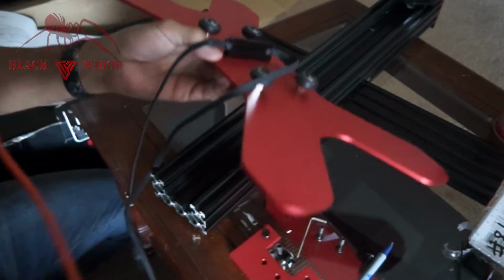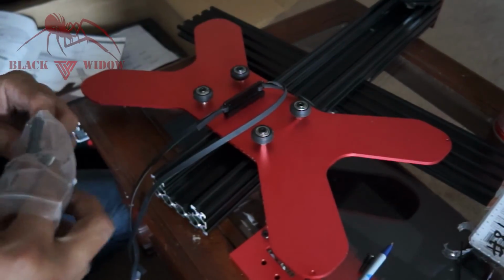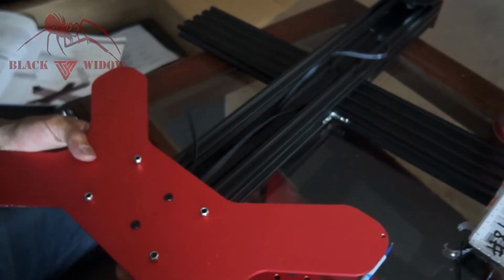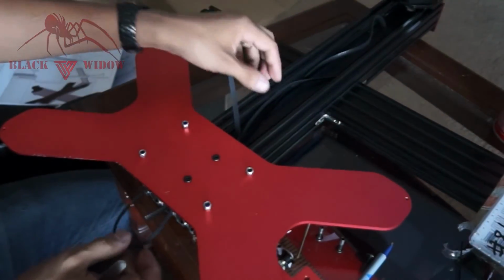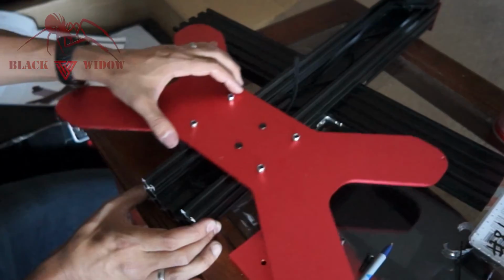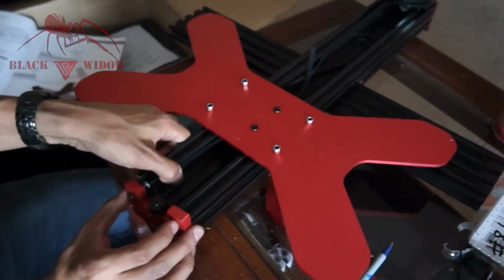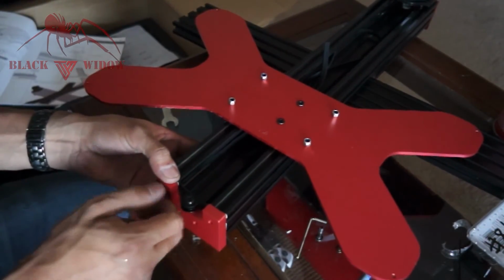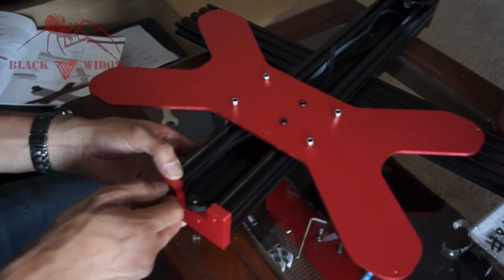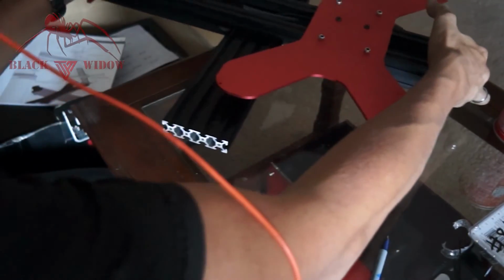And now one thing I forgot to do is I'm gonna adjust my eccentric nuts before I attach the plate back on. So we'll throw the belt inside there. Okay, we'll add the wheels back on. I'm going to adjust my eccentric nuts on the bottom so that it tightens perfect. I'm going to reattach this bracket and the belt around that loop. So boom, there's the first one. Pull this side of the loop back that way, and we'll retighten this on. Okay, we're all mounted here. Pull my loop, go back this way.